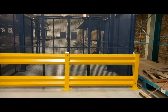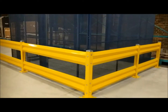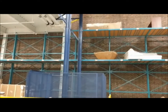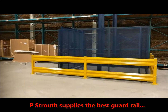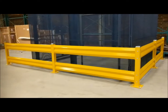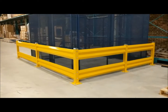Another quality heavy duty guard rail installation by Carolina Material Handling. This is in High Point, North Carolina. We used Wirecrafters heavy duty guard rail to protect this VRC freight lift from being damaged. This lift is in a warehouse in a main forklift aisle with a lot of forklift traffic, so this project would not be complete unless we protected it. We used two 9 foot double rails to go 18 feet, a corner post, and then a 7 foot and a 6 foot double rail to go back towards the wall 13 feet. This will protect this lift from any type of forklift damage.